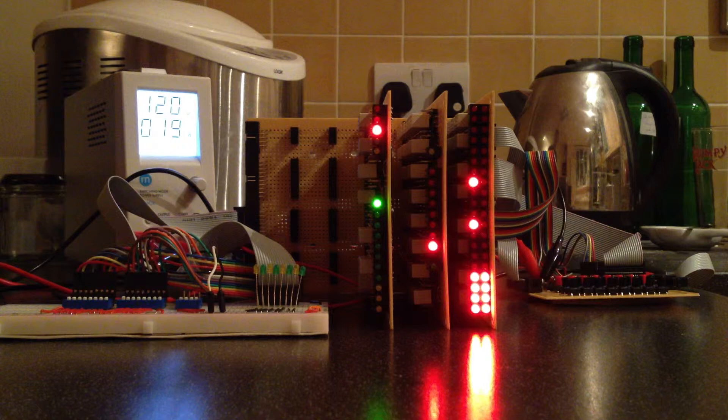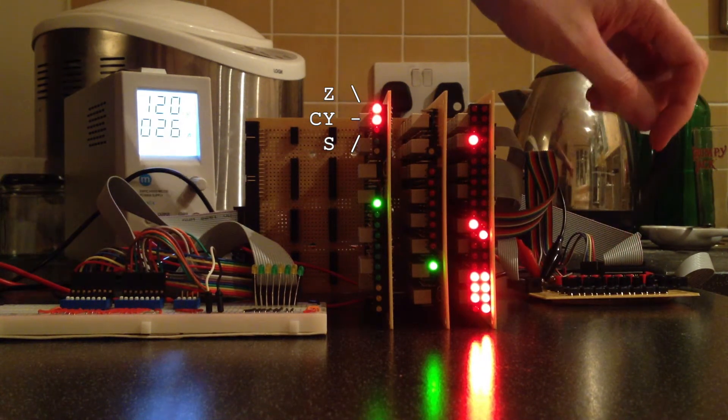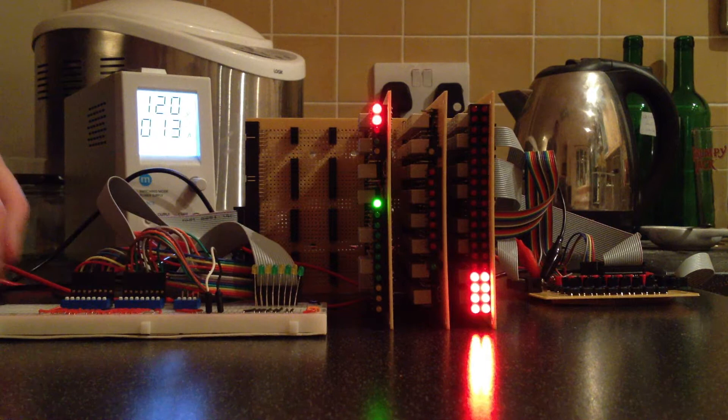Finally, I'll test the carry condition by setting the most significant bit on input B alongside input C, thereby causing a carry on the arithmetic card. This time there's a bit of an oddity — the carry bit is set regardless of whether there's anything gated on the result bus or not. This is because the internal carry control line is passed directly into the control card. I'm not totally happy with this inconsistency, so I'll add an extra gating relay on the arithmetic card so the carry line is only active when the add or increment result is being gated.